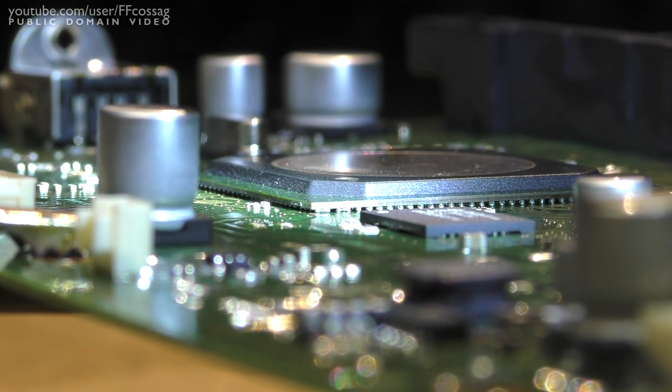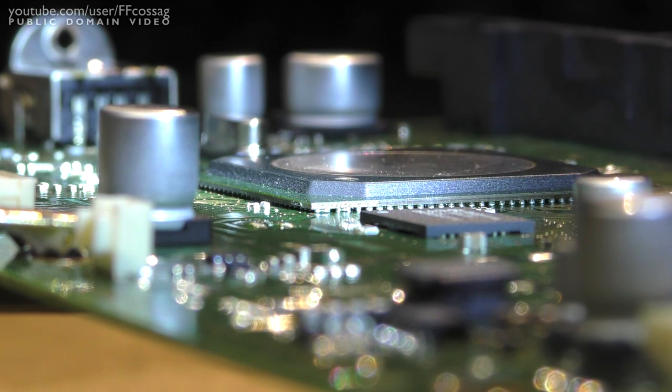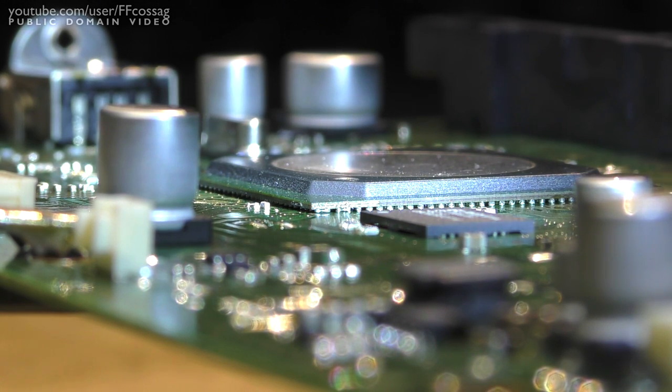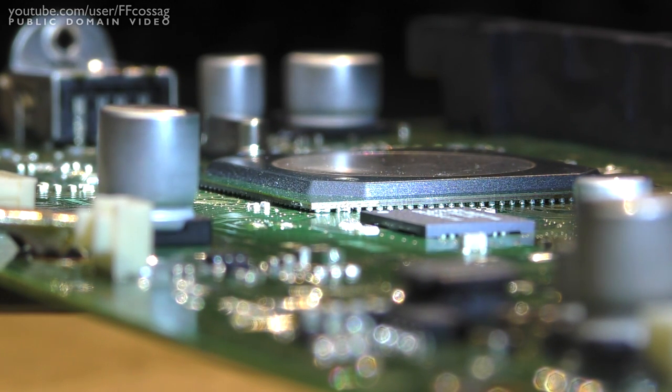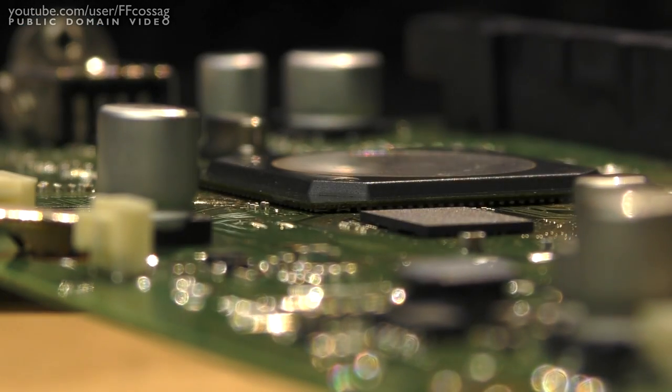I think we might have just bricked this board. Because if you look closely at four of the solder balls right in the corner of the BGA there, they seem to have merged into two. That could be factory if there's some big giant grounding pad there, but that doesn't really make sense out in the corner of the chip. What I think has happened is, since I did the grunty thing and used the big giant heat gun to reflow this, it put so much pressure onto the BGA from its airflow that it actually squished the solder balls by pushing the chip down onto the board. I am almost willing to bet that this board is not going to power on anymore. But we'll give it a go.